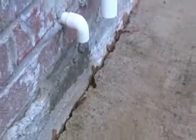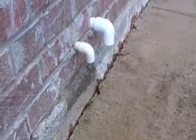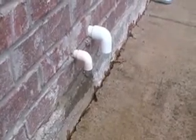And you want to make sure that it's going to stop. Remember, the problem I had originally is that it would not stop because it had a bad valve. You probably can wait a minute or two until it stops dripping. And as long as it stops dripping, you have a good valve. And the reason you really have this pressure release valve is for your own protection. If the temperature exceeds a certain temperature, then it will automatically cause this valve to be engaged, and release extra water.